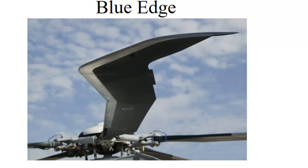Here's an example of a really modern blade. Some of the new blades, like this one, have a little piezoelectric aileron that moves the blade up and down in order to move it out of the turbulent vortex from the preceding blade. That quiets the blade down significantly — making helicopters more quiet is something the industry has been working really hard on.